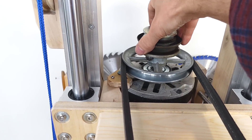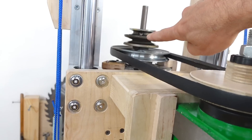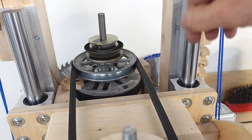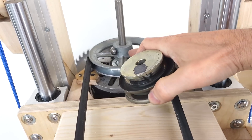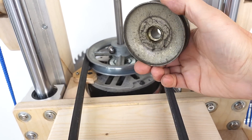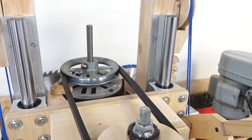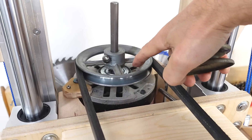This one is fairly close, but if I put that on here it's too far up for a step pulley because I don't have a lot of vertical room. And even if I flip this pulley upside down to put the hub on the bottom, it'd be close enough, but there's no room for the hub below that. So I'm just going to make a wooden pulley to go on here to give me that size.